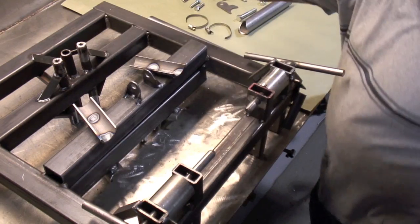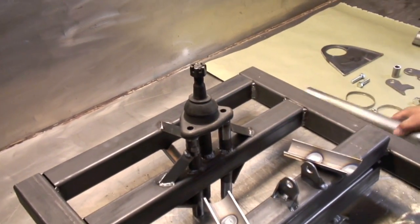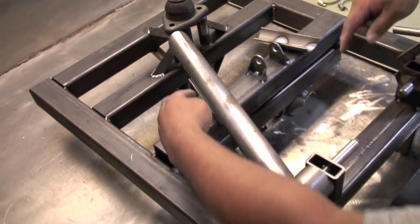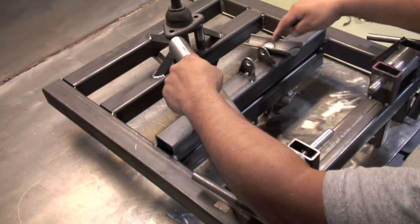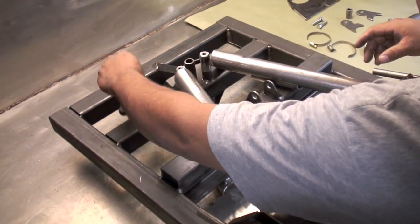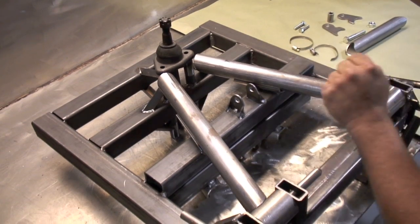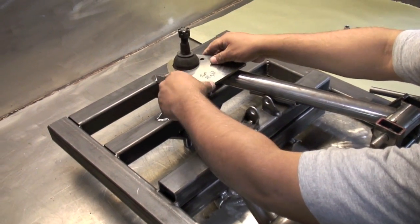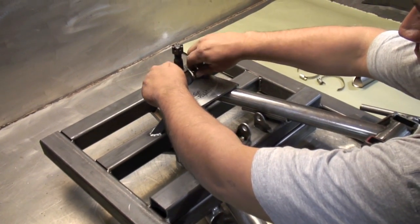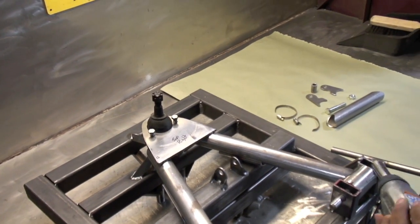Next, we'll lay the ball joint on top and the top studs here. This will be bolted down together with the tubes. Then the rear tube slides into place — it's held by the half-pipe cuts in the cradles to keep everything lined up. We have two pieces here and another one on top, then the top ball joint plate that rides right here on top. We'll stick two bolts in there and bolt it down tight. The more we can bolt down the better — less chance of anything moving when we're welding.